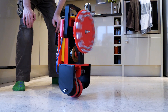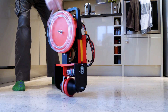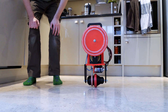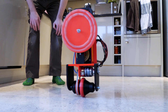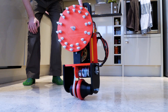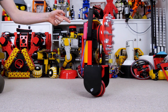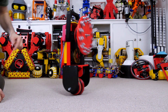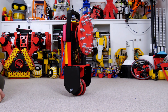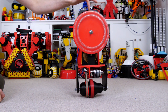I've tuned up the PID controller to make it balance front to back just like a normal balancing robot, and that was pretty easy to do. It's now balancing back to front and side to side using both the drive wheel and the existing reaction wheel. The kitchen floor is quite smooth so it goes quite fast and there's nothing to hold position, so it does wander. On carpet it's a different story because the natural damping stops it running away on its front-to-back axis. I've also added more nuts to the reaction wheel bolts to give them more mass, so the reaction wheel has more stabilizing effect now that we've added the extra motor and battery.